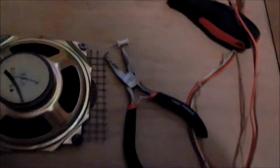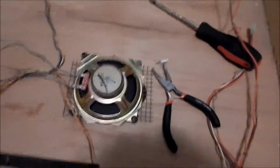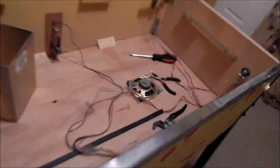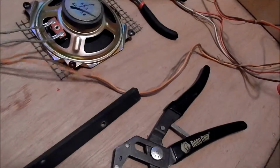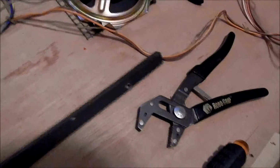And then also, I put in a new speaker, because the old one here, look, there's this old one. Of course it's playing music right now, but see how really worn out it is? It's supposed to be black. So that's why I'm putting in this new speaker. It's 8 ohms, just like the old one. With these gray wire leads, and this just goes here, and here is the pinball piece.